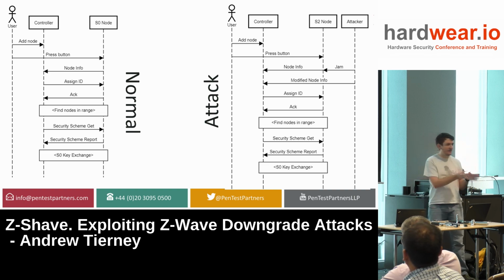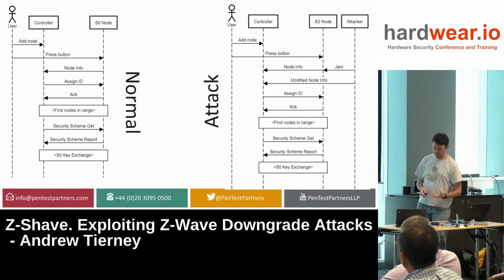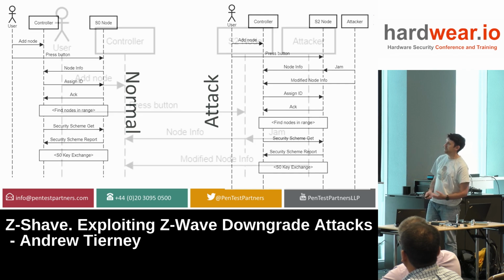We'd receive the part of the packet we need at the beginning. We'd then start jamming it so the controller didn't receive it. We only have to flip one bit in the packet because it's got a CRC checksum on the end of it. Now, that's probably possible. The way we're using this RFCAT device, it has to receive an entire packet before the computer's aware of the data. So there's no way to easily reactively jam. So we haven't actually got this one working, but it's conceptually possible.